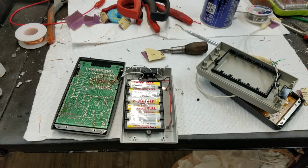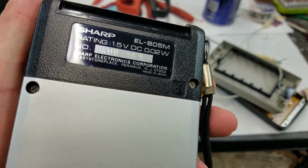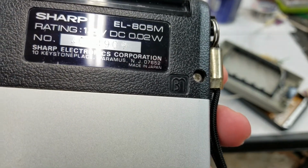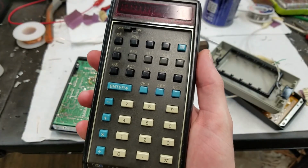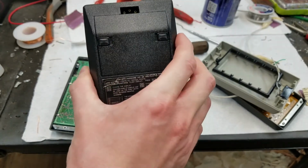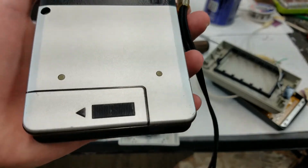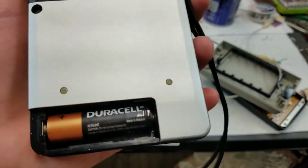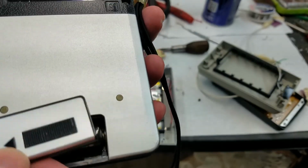That's 500 milliwatts. Look at this one. This is the LCD. That's 20 milliwatts. So quite a difference there. And of course, that's why these use rechargeable batteries, because they draw so much current. You're draining the batteries all the time, so it's better to use rechargeable ones than to keep throwing out and replacing the batteries all the time. But this one, because it uses so little, they just have one non-rechargeable battery in there, and this battery lasts for a long, long time.